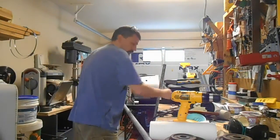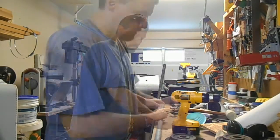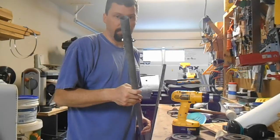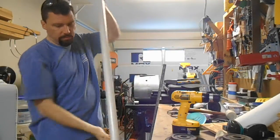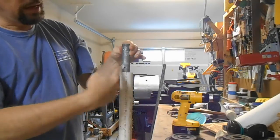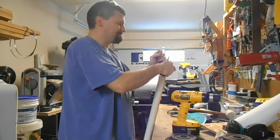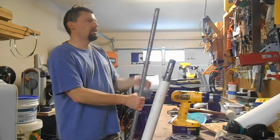Got my new hole drilled, so I'm going to go ahead and put one of them in. That's one put on. Just slap on your length of PVC pipe — that keeps it from sliding around. Here's the old one, here's the new one. You can see it's going to give me a lot less play and it moves the bolt down a bit, so I shouldn't have the chafing problem where it was rubbing in the groove on the vertical upright. Now all I've got to do is drill the two new holes in the other pipe.